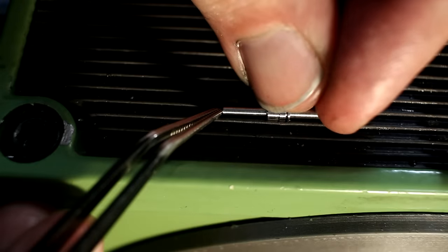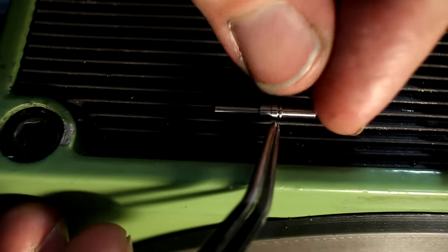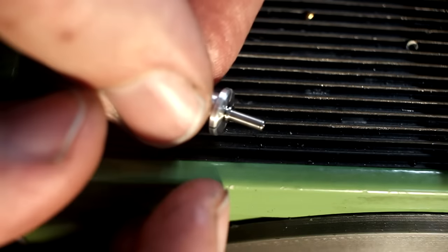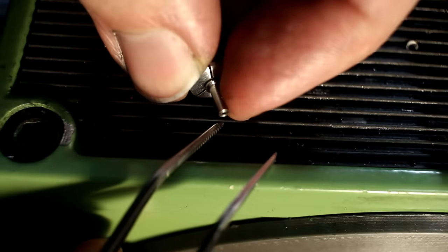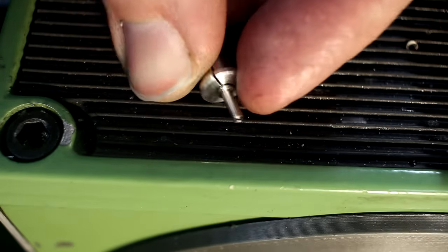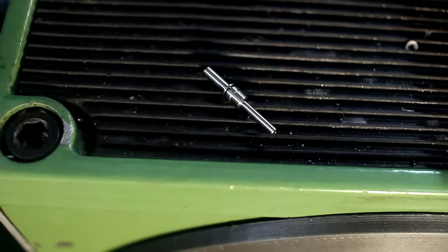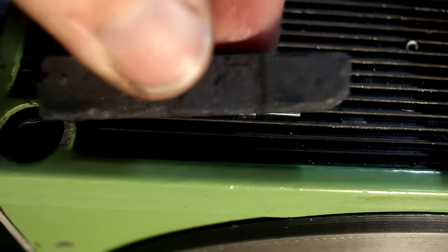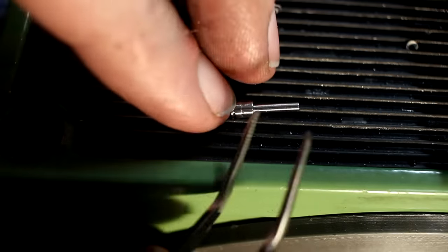Everything from here out, the end up to the groove, that's all first side operation, all turned in one setup. Then I made the sub collet, held it like this, and cut the second side and drilled the end with a 0.7 millimeter drill, 700 micron. The other side has 1,000 micron, otherwise known as a millimeter. All surfaces, I hit everything once I was done with a Kratex stick, rubber bond, fine abrasive, and this takes off all tiny burrs.